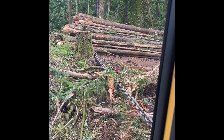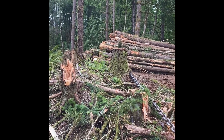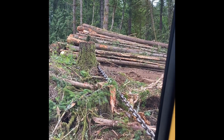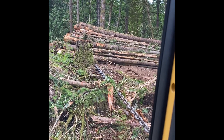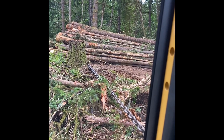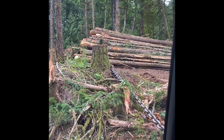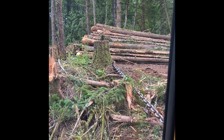You've got to trust your stumps. I'm on top of a bank so my line is dug into the bank before it's dug into that stump, and you try to keep your line really low on that stump so it doesn't pull. You've got to pick your stumps, leave more than one if needed, and go with your gut instinct. I've only had maybe one stump pull out in the whole time — I pick my stumps pretty well.